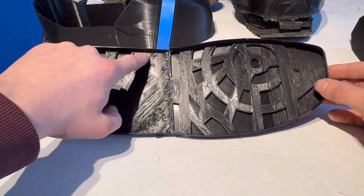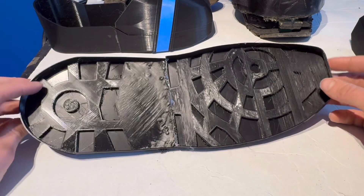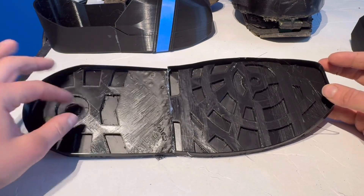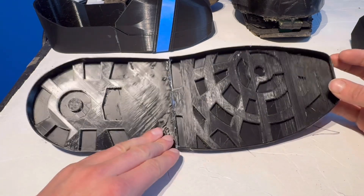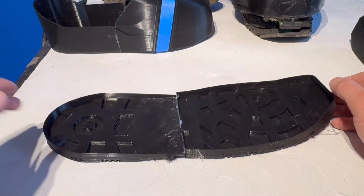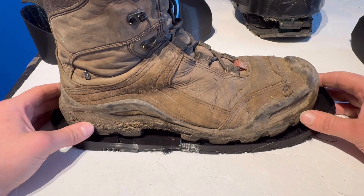Moving on to the sole mold — this came out as a mixed bag. The 3D printer messed up here; I think my old Creality printer has seen its day as it's failed a few times recently, so I haven't had time to reprint this bit. I kept it at about a 1mm wall thickness with supports underneath, because I basically want it to be easy to sacrifice when getting the sole out of the mold — just snap the pieces off. The rubber resin is far more expensive than the print, so it's better to sacrifice cheap molds. Overall though, you can see it's thinner so you'll be able to press pedals in vehicles, and it's still longer than the operator's boot to give some ground pressure reduction while still being usable on stairs.